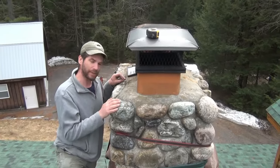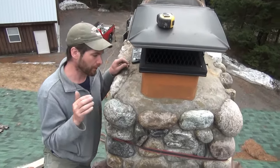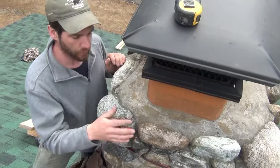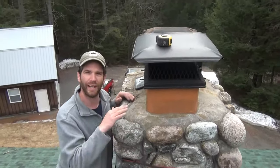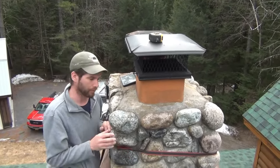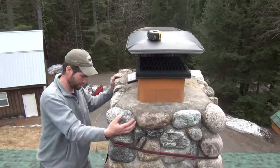This chimney failed — beautiful fireplace, only about 20 years old. The reason it fails is it doesn't have a good quality concrete cap. We're going to show you the steps. It's not that hard to get your lumber around this thing, chink in these holes, and pour a nice cap that goes out, gives it a good overhang, lets the water drip free of it with a drip channel in it.